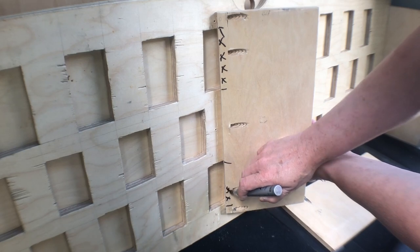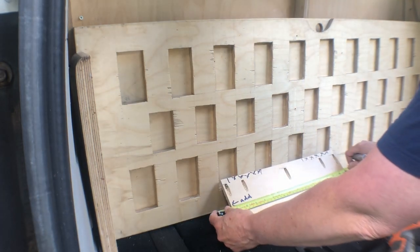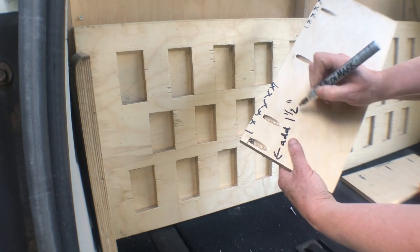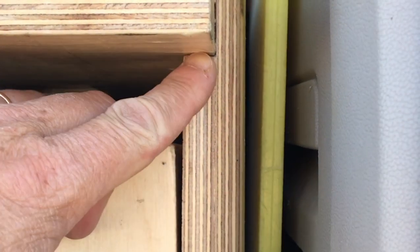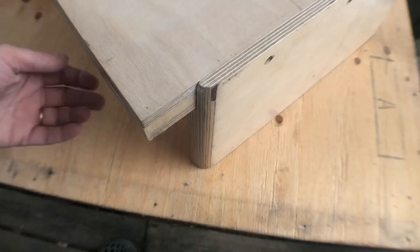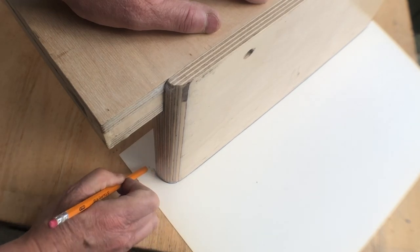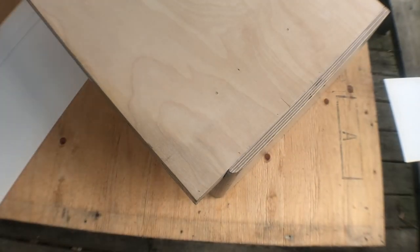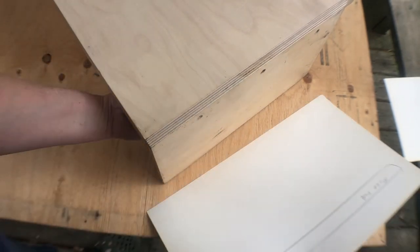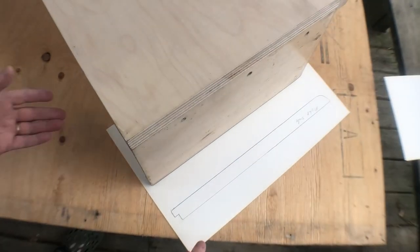This time I'm going to mark where the holes are. I think I'm going to make the legs an inch and a half wider. I can't remember why I made the legs less than the width of the kitchen, which could be a bad sign, but if it's a mistake I can always take them off and shorten them again. The outside legs are going to be more of a problem, because a second piece acts as a support for the shelf. It would be a waste of a lot of wood to remake them, so instead I'll just add some feet to them. They'll have to follow the shape of the existing leg — I do remember why I did that, as they have to fit inside the plastic edging on the liftgate floor. It's easy enough to trace them and make a template to cut the pieces to add on, and I'll make a note of which one is which in case they're not quite the same. I'll cut two pieces each out of half inch plywood and stack them on top of one another. The lines of the plywood will be going the other way, but it should look okay — if I kept them vertical to match they might split when I drilled the holes for the screws.